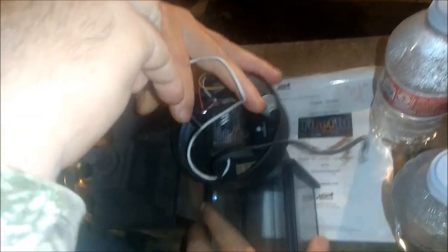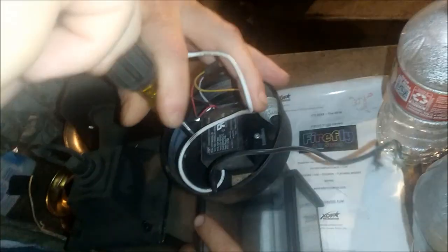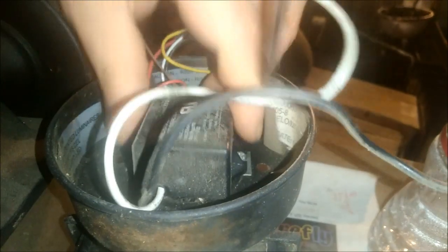So you're converting it back? Yeah, I'm converting it back to a conventional fixture. First thing I've got to do is get rid of this ballast for the LED. We'll do that probably with a number one Phillips — number one is smaller than your average Phillips, one size smaller. Number two is most common, in case you didn't know that. So we can pull the screws to this ballast and see what we've got in here.